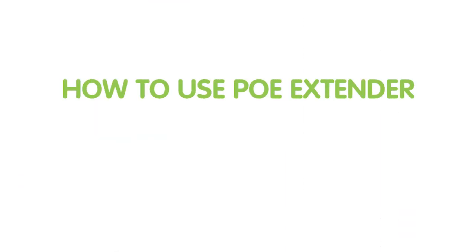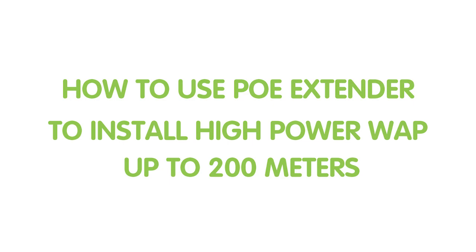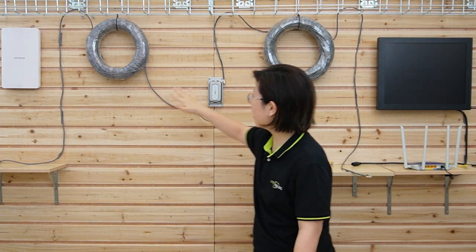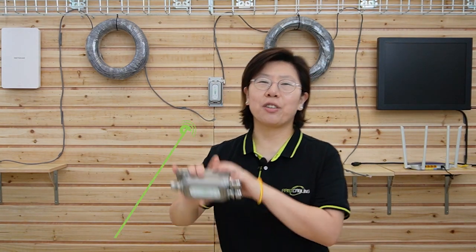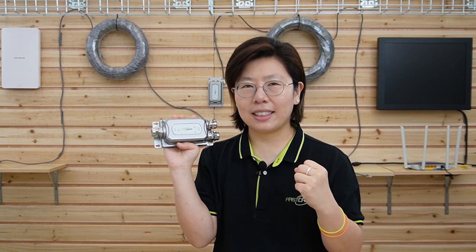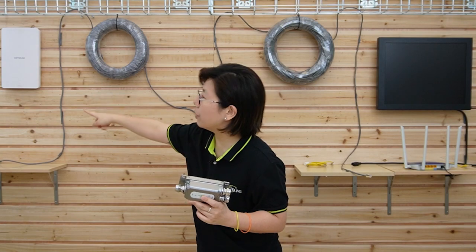Let's move on to the demonstration board and I'll show you the whole setup for today. We're going to connect the wireless access point and extend the distance to 200 meters using the PoE extender. It can transmit both power and data over that distance — it regenerates the power and amplifies the signal to ensure transmission over a longer cable run, repeating this process for subsequent cable runs until the PoE signal reaches the edge device.